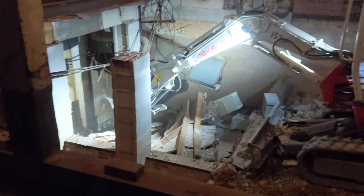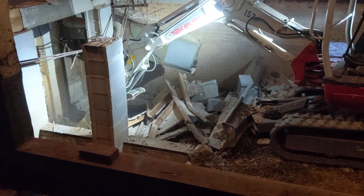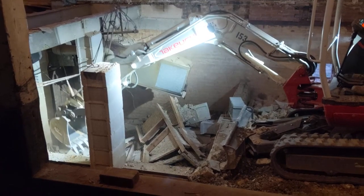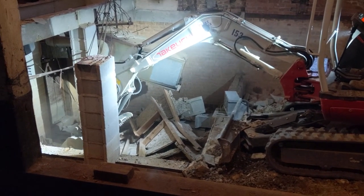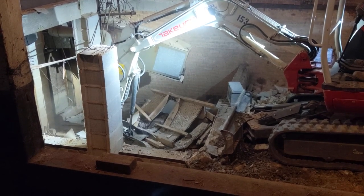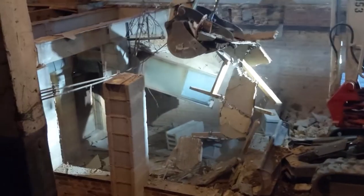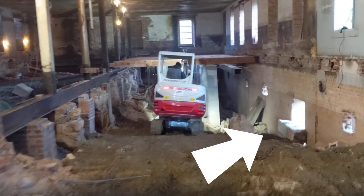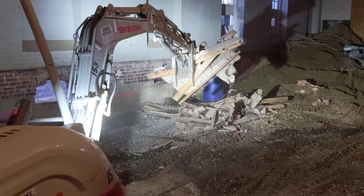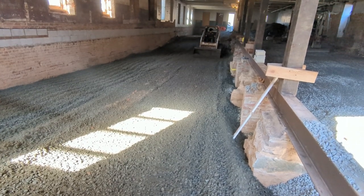As you're pulling the floor joists out of this building, the masons are literally the same day going back and fixing that wall, because the new floor will be 18 inches lower than the original floor. All those beam pockets, messed-up bricks, and wooden ledgers had to be removed and masonry put back in their place — and that will eventually be plastered over. You'll still see traces of what used to be there when we're all done: where the beam pockets have been replaced, where the old crawlspace vents were. And presto — we have a crawlspace full of gravel. Three million pounds of it.